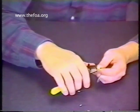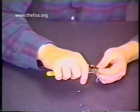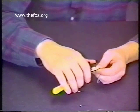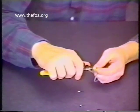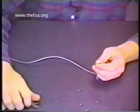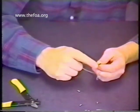The PVC buffer is adhered very tightly to the glass — hence the term you'll hear out there in the field: tight buffer. If I take large bites, I could actually break the glass from the strength of the buffer holding onto it. I leave approximately an inch and a quarter of length of buffered fiber.